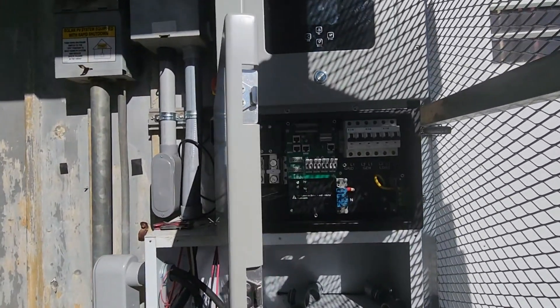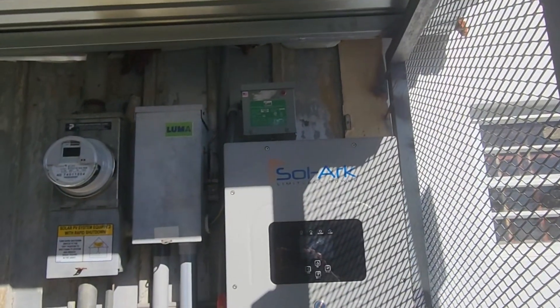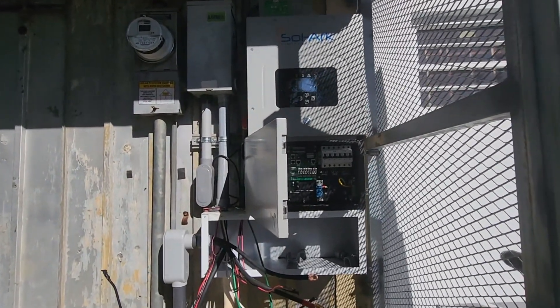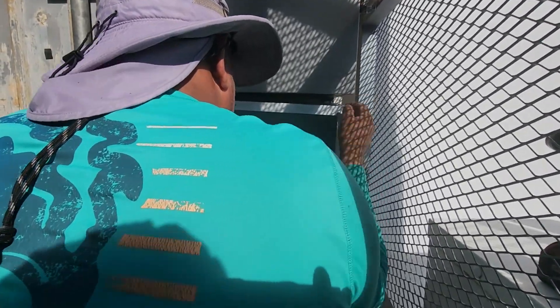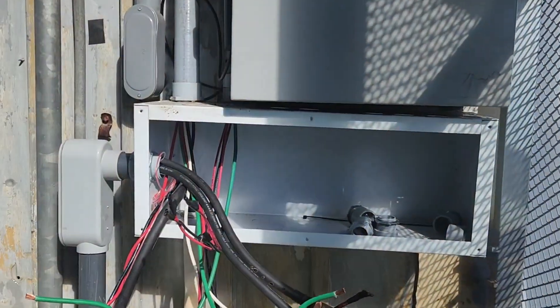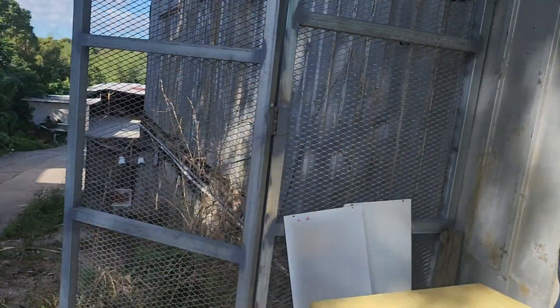We're going to have to move up the 15K because it needs space to ventilate from below. So we're going to take off that little box right there — that's a K-bar energy controller — to move it up about 10 inches and then place the 15K so it can have space to ventilate. Here's my trusty friend Aníbal helping me dismount the inverter. Aníbal already dismounted the inverter and put it to the side. That inverter will be reused by the customer.